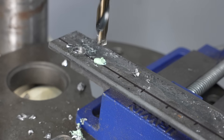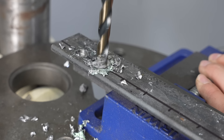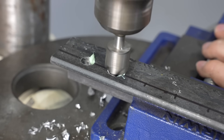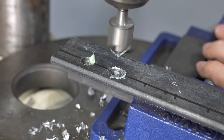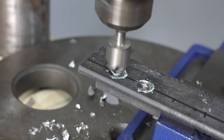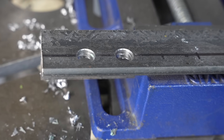Let's look at the actual technique itself — it all starts with the hole. Make sure to use the right size drill; look it up in a chart. Don't estimate on that because it's pretty critical. And it's always a good idea to put a little lead-in chamfer on your holes — just enough to help guide your tap into place and to help your fastener get started also.